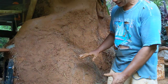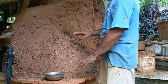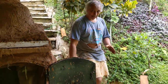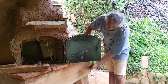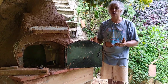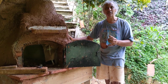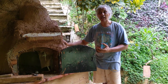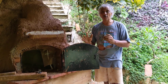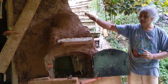First we built a very solid base and then I put the bricks down. It's starting to rain but luckily we have a good roof, good hats, and good boots, so the rain does not affect us at all. The base is 10 inches thick. Some people say an insulated base isn't that important because all the heat rises, but I do think an insulated base is very important for heat retention as part of the thermal mass. When this oven is properly fired up and fully cured, we should be able to get 24 to 36 hours of cooking ability.